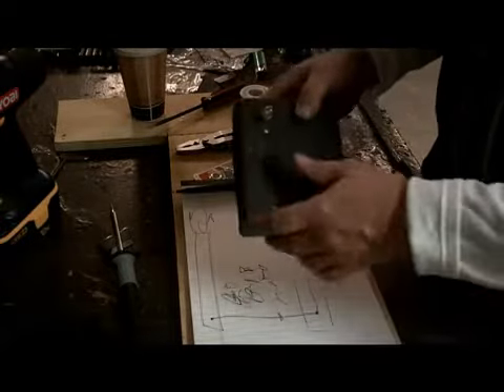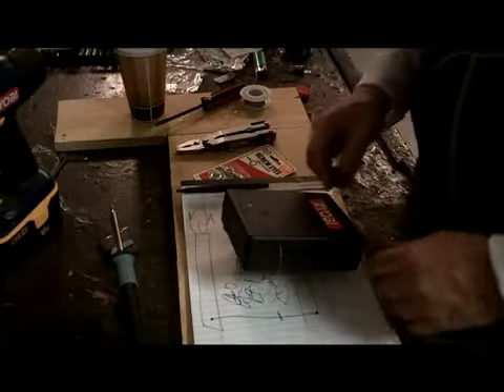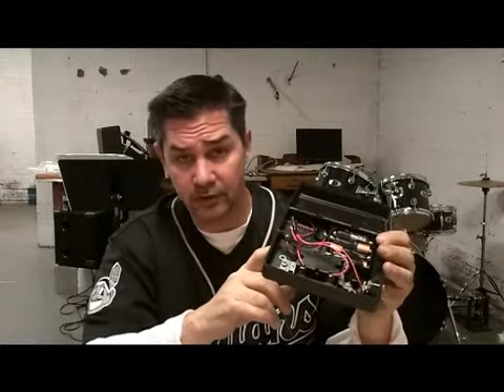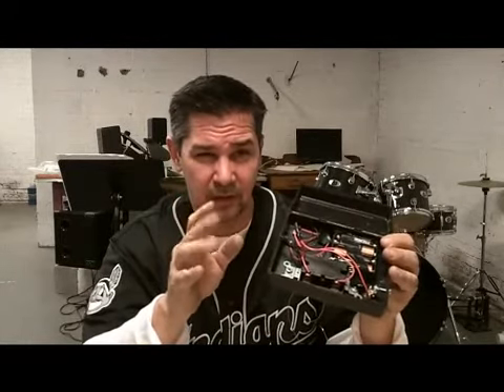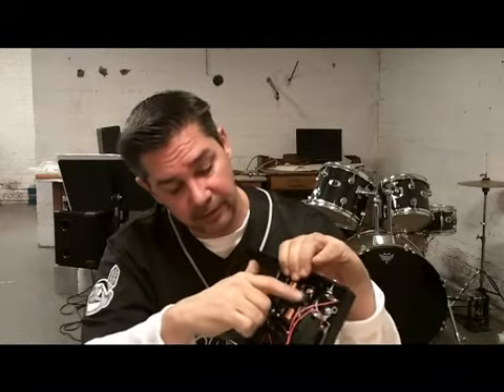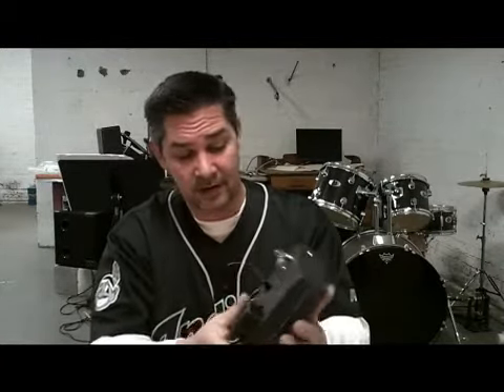I hope this helped out and you generally get the idea. Your little device — really cheap to make. Very high tech! State of the art, right there in your little drill bit holder. You've got your switch, your battery, your battery holder. The buzzer is rated 6 to 12 volts, the light bulb is a 6 volt bulb, and this battery pack with all the batteries equals 6 volts total. Very cheap to make — the switch I found laying around. The only thing I really bought was the siren. Early warning.